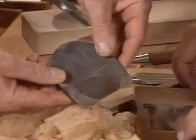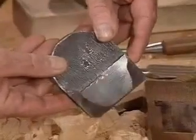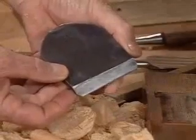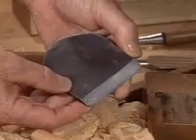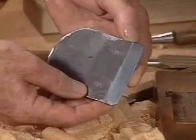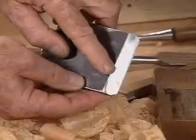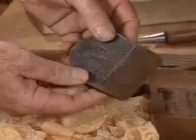And I can see on that face there, this is hollow. That's been hollowed on the back face. Is it two layers? It's laminated steel, so if you turn it over on the bevel side, you can see this very bright area on the bottom. That's an iron with carbon. It's a high carbon steel, and each individual blacksmith can forge that to have certain properties. That's that bright layer down there, right close to the edge. So like a layer 1/16 of an inch thick on the flat side. What is the backing material? The blacksmith forge welds that to a backing material, and in this case, it's wrought iron, which is just a no carbon iron. So it's very tough.